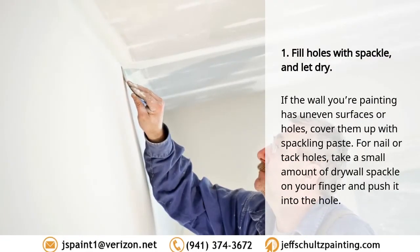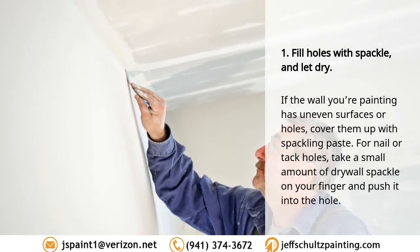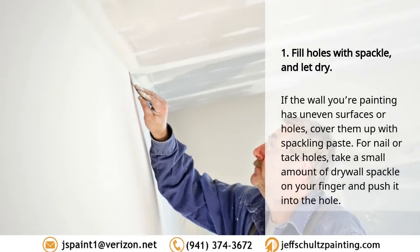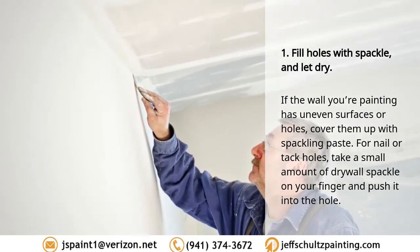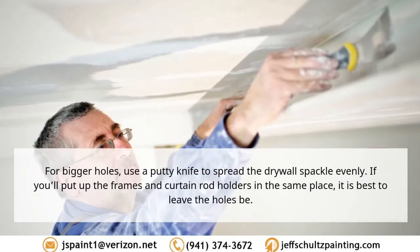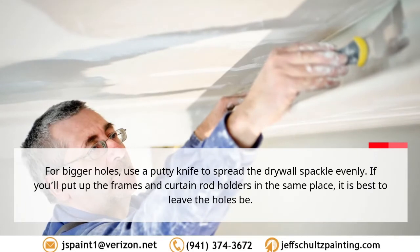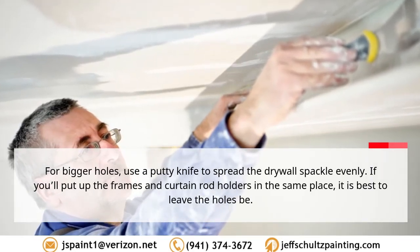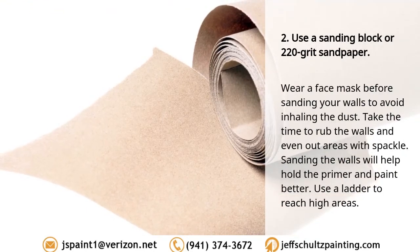1. Fill holes with spackle, and let dry. If the wall you're painting has uneven surfaces or holes, cover them up with spackling paste. For nail or tack holes, take a small amount of drywall spackle on your finger and push it into the hole. For bigger holes, use a putty knife to spread the drywall spackle evenly. If you'll put up the frames and curtain rod holders in the same place, it is best to leave the holes be.